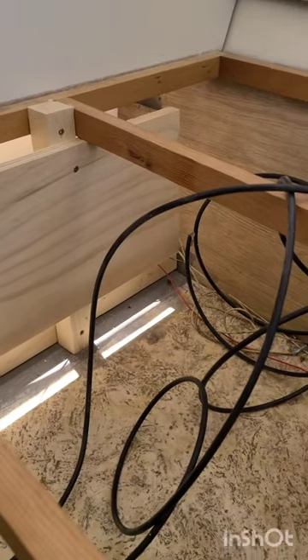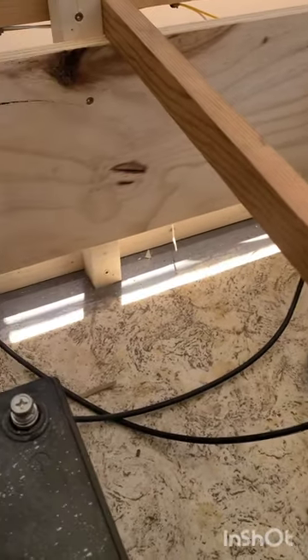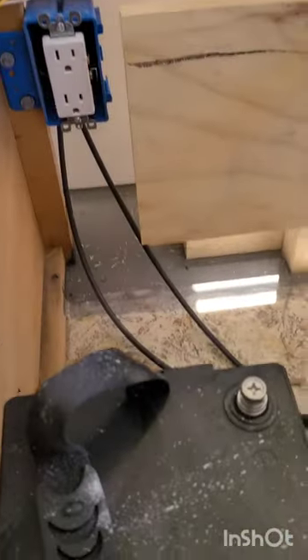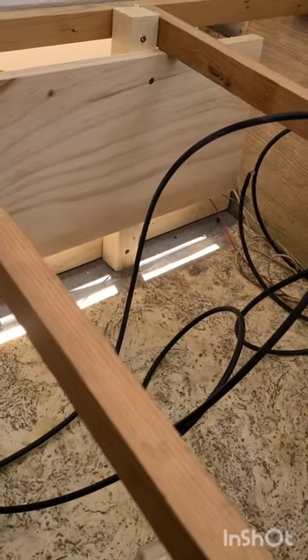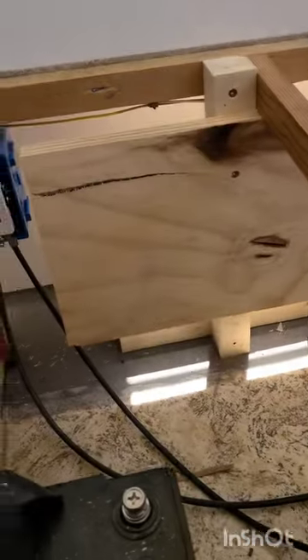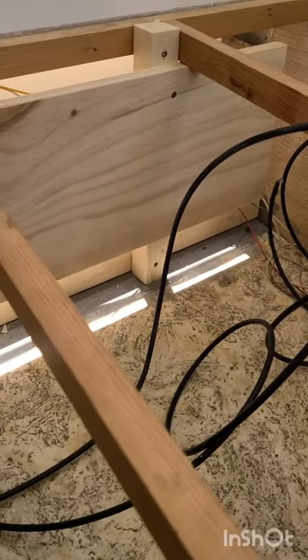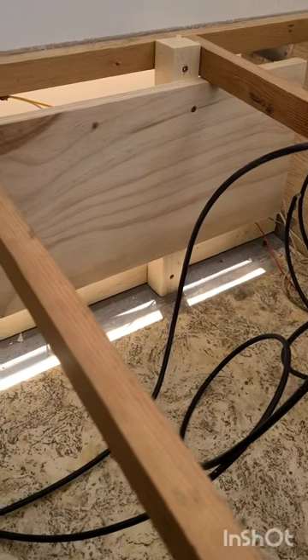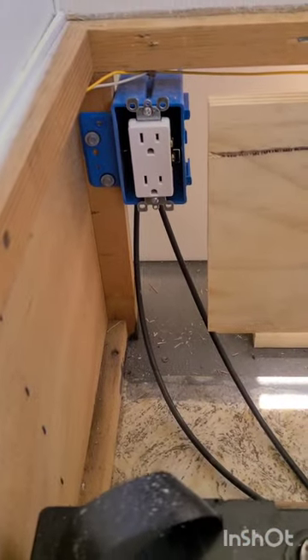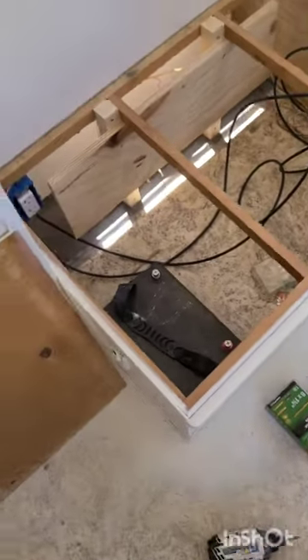Here's another look at the battery compartment. First and foremost, I'm making sure no water is going to be able to get to this electrical system, so it's raised off the ground. I also want really good ventilation because some of this stuff does create heat. I'm going to have my charge controller, DC fuse box, and MPPT controller mounted on there off the ground, and we'll do some wire management. My 110 AC here is also off the ground, and we've got a lot of ventilation in this compartment that will ultimately be hidden but still well-ventilated.